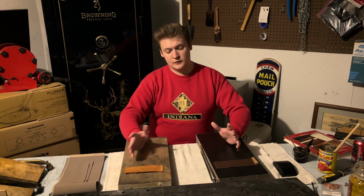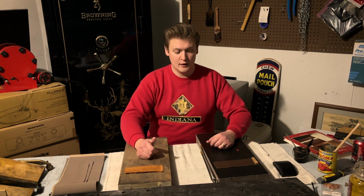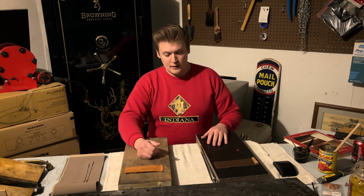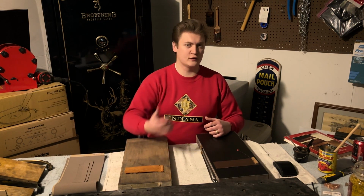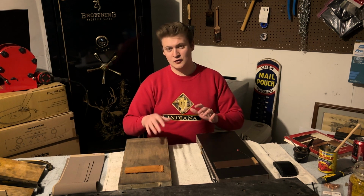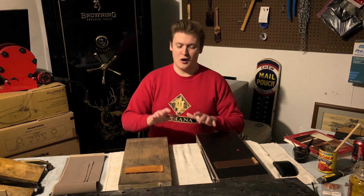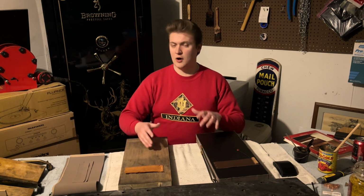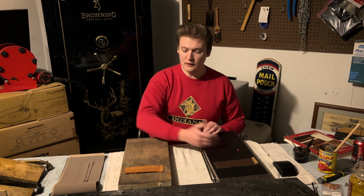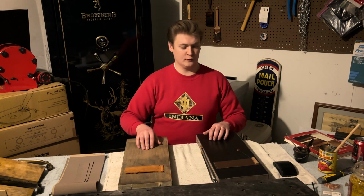Depending on what you read or who you're talking to, they're either called the exhauster bellows or the treadle bellows. I tend to call them the exhauster bellows. Some folks call it a sling blade. I call it a guider blade. And if you're familiar with how to operate a player piano, you know that there is a secondary set of pedals, technically treadles, that come out from the knee panel that the pianolist will operate with his or her feet, and that will generate the vacuum to run the instrument. And while you're operating the pedals, what you're actually doing is driving these two fellas right here, the exhauster bellows.